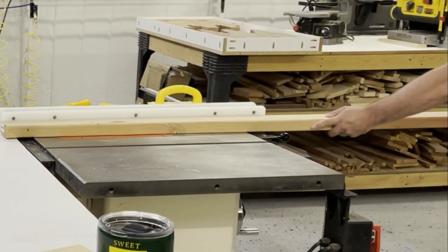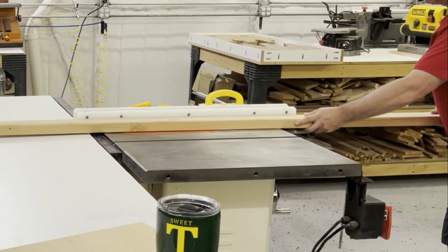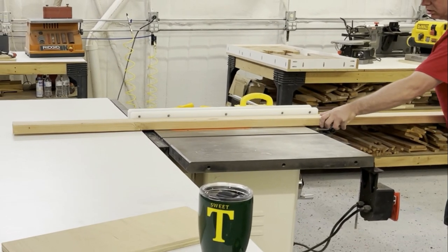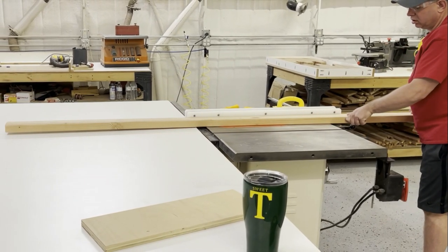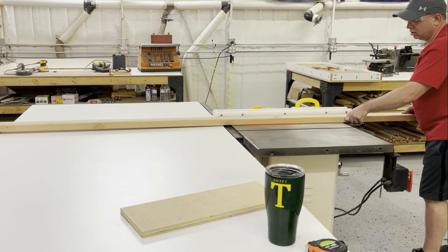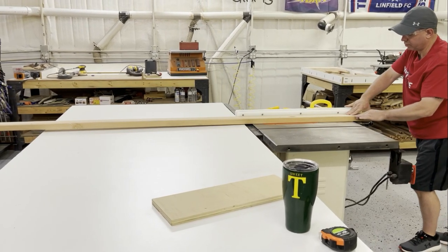So all we need to do is make a frame that's a little bit deeper than the insulation. I'm going to do that with the table saw. I'm going to use some leftover 2x4s. I'm not trying to spend a lot of money on this thing. So if you don't have access to a woodworking shop or whatever, if you don't have tools like this, then go ahead and just buy material that's the right thickness and width, and you'll be able to do just fine.